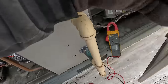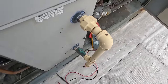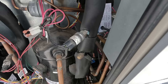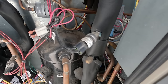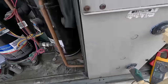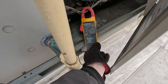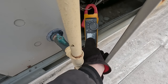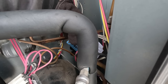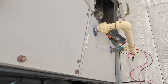When this fails out, it will blink. LED lights blinking — one blinky blink and retry period. They literally ran a ground to it, which is kind of unusual for them. I think the white wire there is my ground for my gas valve — yeah, it is. The main valve has a white. There's W1, so we're on W1. See if this thing will do a retry here. We'll go ahead and put it on max — that way if we miss it, it'll catch it. Three trials, eight-second trial, 30-second pre-purge, five-minute retry. Power's the red one so we can reset the power.